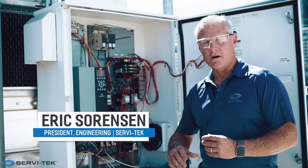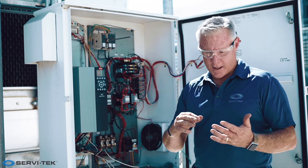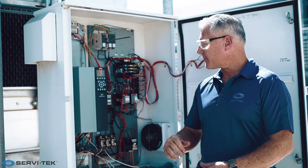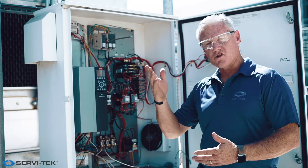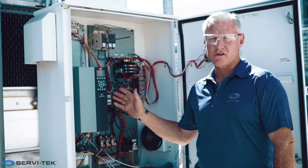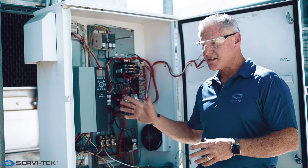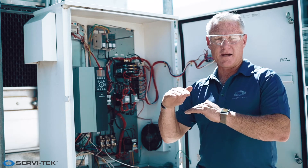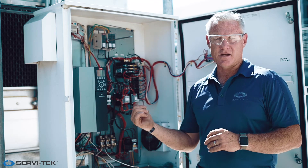As we're talking about these cooling towers, one of the things we're looking for — regardless of whether it's an evaporative condenser, fluid cooler, or open condenser water flow — is something that has a variable frequency drive. That means it's going to control the system based on the needs, tied to an energy management system. Sometimes it can be stand-alone, depending on what it's sensing, which is typically temperature control to maintain a certain condenser water temperature that goes back to the chiller.